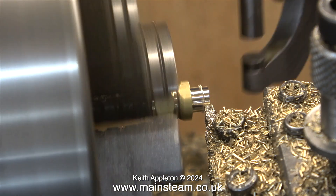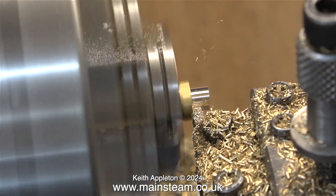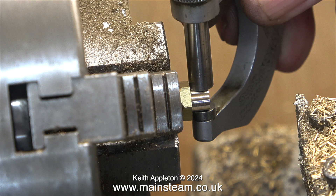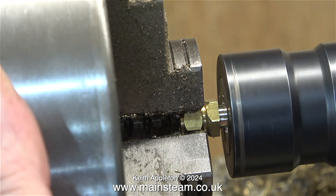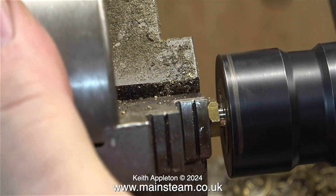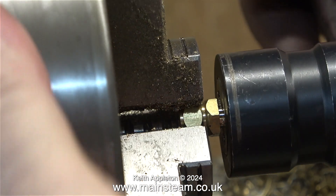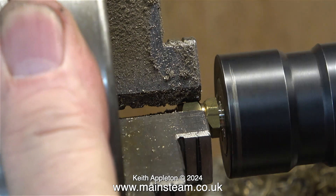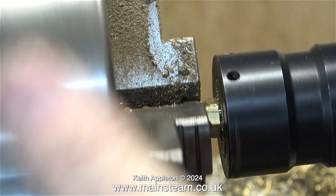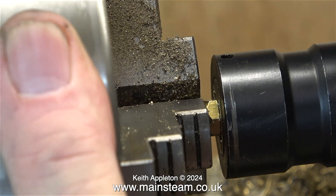This I think will be the final cut. When threading using a die, there are two things to consider. The diameter that you are threading needs to be what it's supposed to be — in this case quarter of an inch — and here I'm verifying with the micrometer that indeed it is quarter of an inch in diameter. To remove the old thread and reduce the diameter down to quarter of an inch, I screwed the part into a union nut, because there isn't really enough hexagon to get a grip on, and if I grip it by the threads it's all going to go spectacularly wrong. I always set my dies to optimum cut. 99% of the dies that I own are split dies, so you can slightly adjust them — open them up or close them slightly, which will cut an undersized thread. Sometimes the standard setting of dies cuts an undersized thread; you need to check this before you use them.